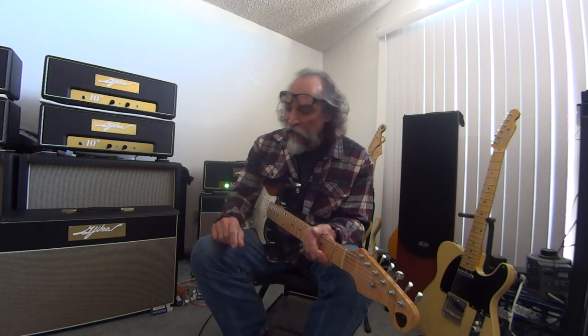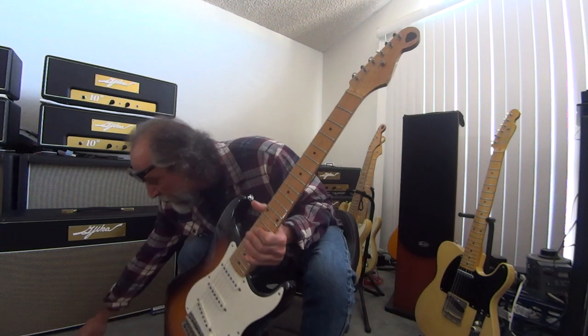And then, of course, everything I taught you in the other video about phasing, and why not flip the speaker if you got two amps that are out of phase? They're real oddball amps, and the speakers are out of phase. If you flip the speaker, you haven't hurt the tone at all. It's just a passive thing. You haven't put your guitar through some junk, you know? Because bad enough, you got your guitar through this kind of junk.